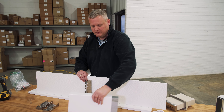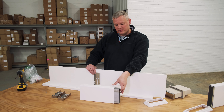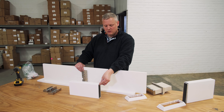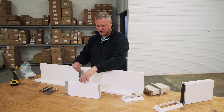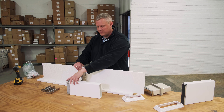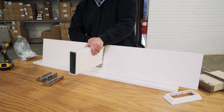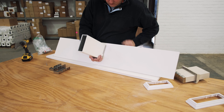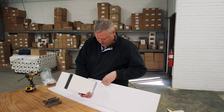Once that's installed you can hang your rafters. The key to making sure the rafters are installed right is that the aluminum is flush with the back of your rafter. If the aluminum is pushed away inside, when you go to screw it you're only going to get into the vinyl and that's not going to be near as sturdy. So you want to make sure the aluminum is all the way flush — this piece should just slide in like that — and then you're going to fasten in through the side of the hanger to the rafter.